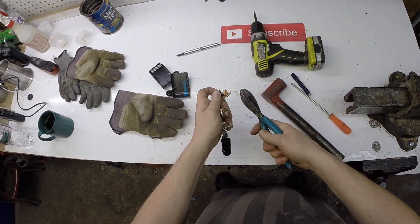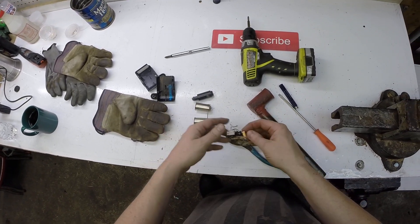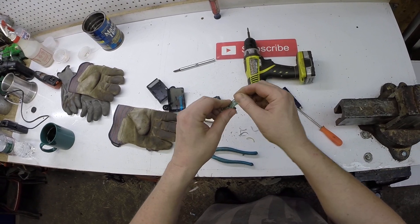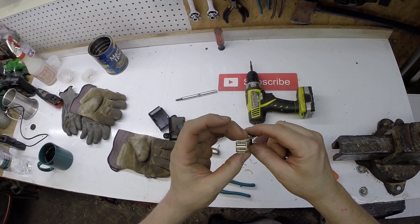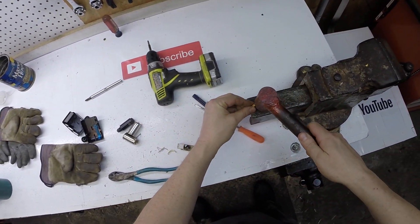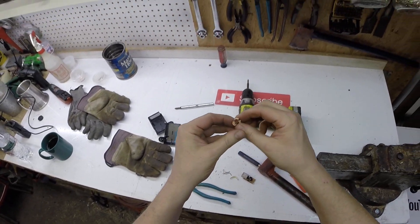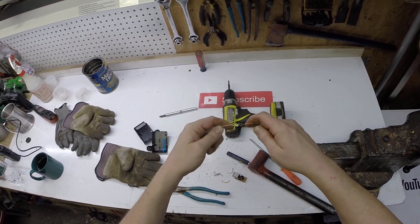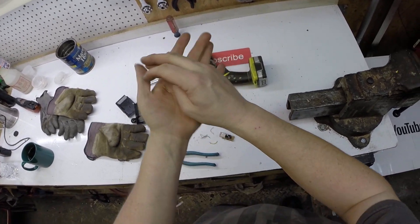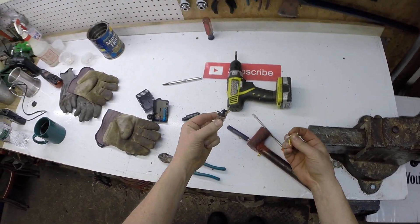These little bits do add up. People think I'm crazy, but this stuff does add up. Most scrappers wouldn't even waste their time with this — they would have thrown this whole thing in the copper-bearing bucket. Just a little piece of copper-bearing board. And that little donut's made out of ferrite — it'll stick to a magnet, but the copper won't. So you just clean this up, get the chunks of ferrite out. These ferrite chunks can go in your tin bucket with your screws and such, and this can go right in a copper bucket. So we got some number two copper, just a little bit of number two insulated, and a little tiny piece of circuit board.